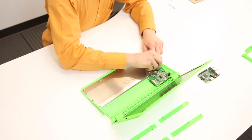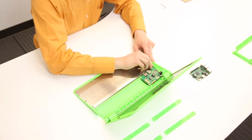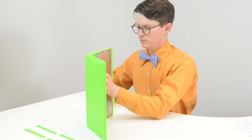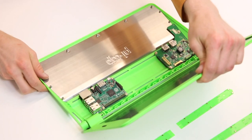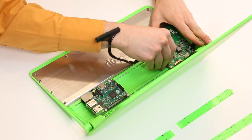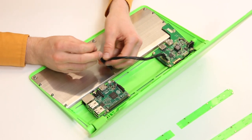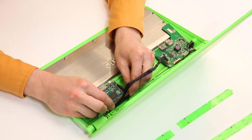The instructions specifically say not to use any tools, so just hand tighten it to have it make contact with the gold pad. Much like we did for the hub, use the silver bolts and the larger Allen wrench to attach the Raspberry Pi to the right side of the base. I recommend leaving about an inch between the Pi and the edge to allow room for the USB cables later. Gently attach the GPIO cable to the hub and the other end to the Raspberry Pi. The hub side is keyed so it will only go in one way; however, the Pi side is not, so make sure that the notches on the cable's connector are facing the inside of the Pi.